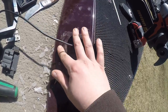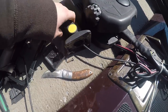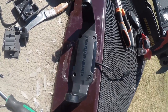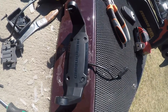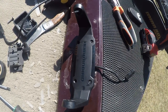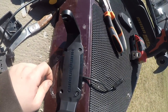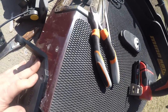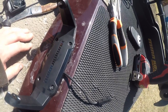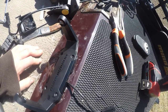Now I'm going to install the old mount and cover up as much as I can. As you can see, the mounts are pretty different here — the Hummingbird Helix 7 versus whatever this old Hummingbird 400 TX was. Fun fact for the day: when you're drilling into aluminum, always drill a pilot hole or you'll break your screws. It looks like I've got this in there pretty well — finish off drilling these two now.